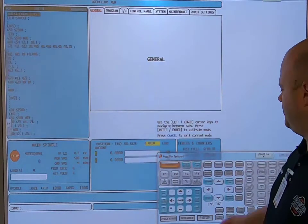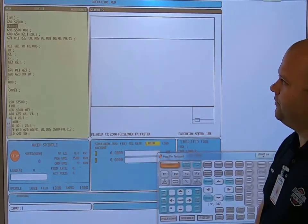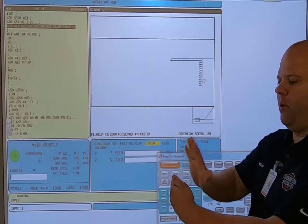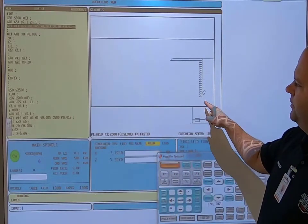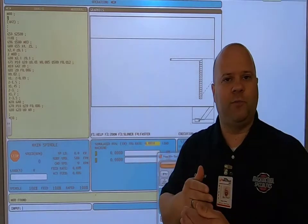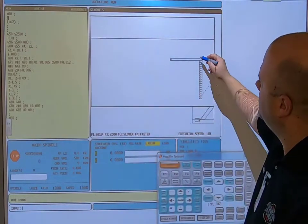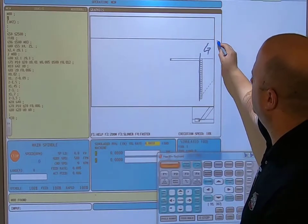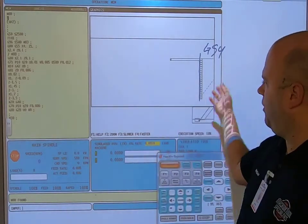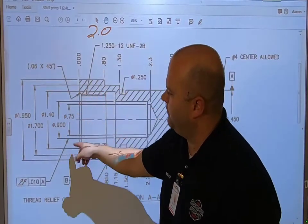G54 is six inches, G55 is six inches plus one hundred thousandths. Let's run the simulation at ten percent speed. The first thing it does is take a pass — notice all the tool pressure is pushing the part into the jaws. The last thing it does is come up and do a face pass: a semi-finish and a finish on the face, so all tool pressure is pushing back toward the chuck and not coming down.